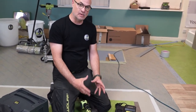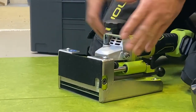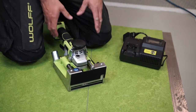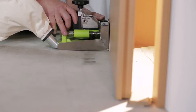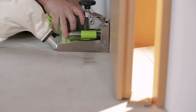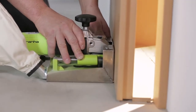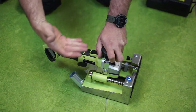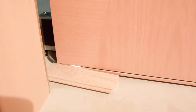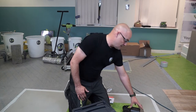Some important safety features: the blade isn't exposed at all, and it goes back into its case once you've performed your cut. When sliding along the floor, you really need a flat smooth surface. If you've got an uneven surface, it's always important to put some plywood or a piece of timber down and adjust your cut to the depth accordingly — the tool always needs a smooth flat surface to run along, otherwise the door is going to jam up and the cut will be affected.